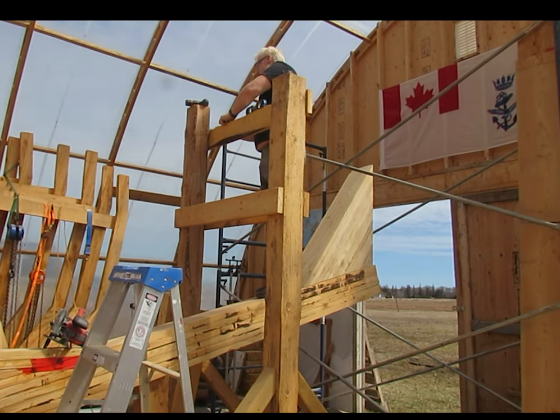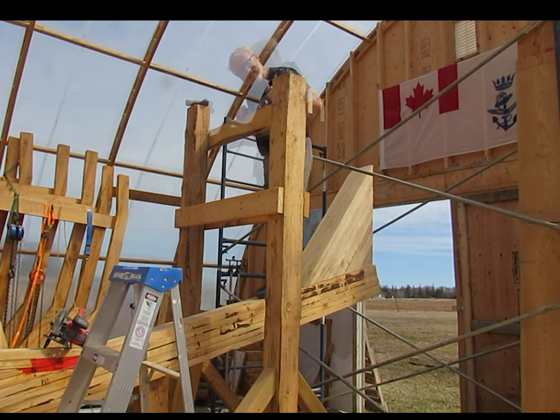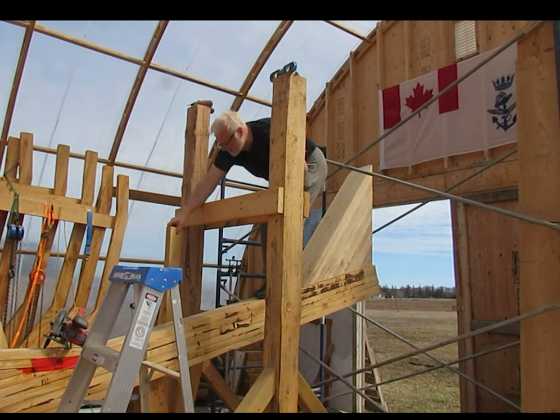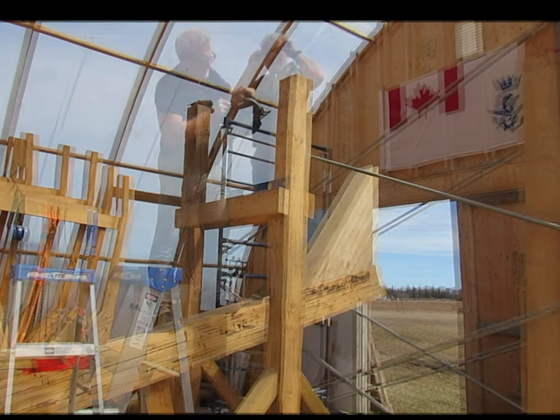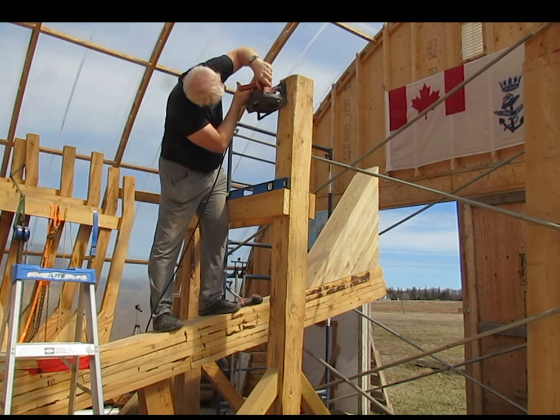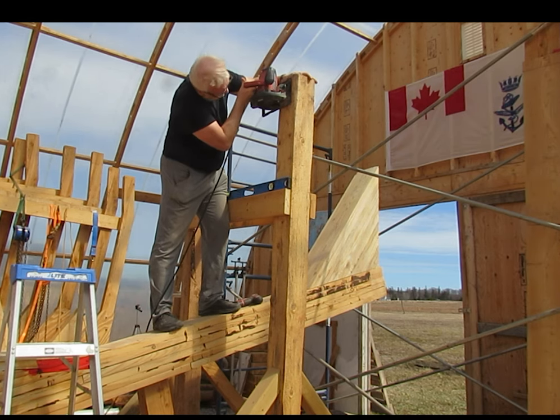To lift and position the keel assemblies and later on the frames, a gantry crane with a chain hoist must be built. Before the upper structure of the gantry can be constructed, the existing cross bracing of the gantry base is strengthened by creating a rabbet joint. To do this, a notch is cut in the top of the supports for the 2x6 cross bracing to fit in flush.